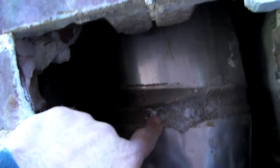And if you come out, you can see where they've knocked their hole well above the fitting. That's way too high. We've got to connect the fitting down below here, where we've knocked this access hole. And now we have to disconnect the pipe here, where this slight offset is, remove this, put in a proper one, and brick this back in.